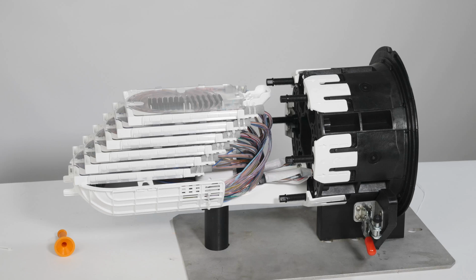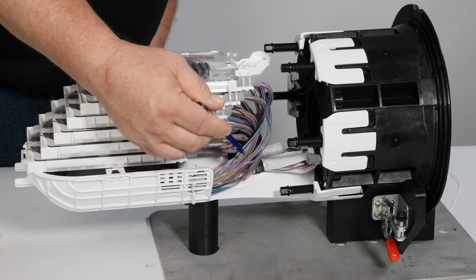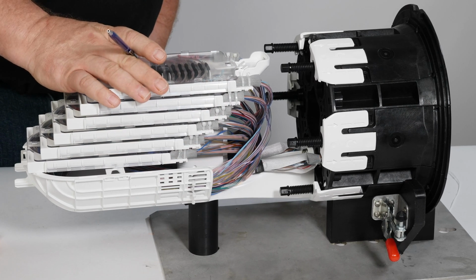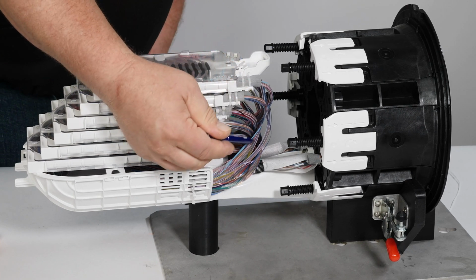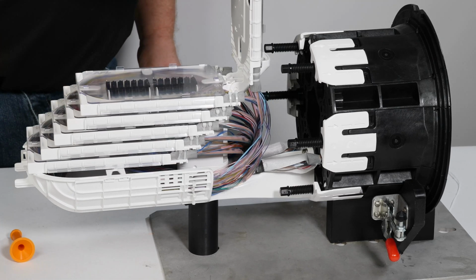It is recommended to install or route fibers to trays one tray at a time to prevent trapping if a tray needs to be removed later. Trays must be filled from bottom up with no spaces left open. Once all trays have been installed, adjust the slack fiber under the yoke to prevent binding or excess fiber to snag.